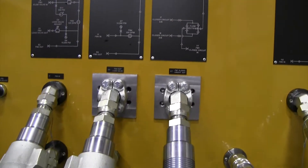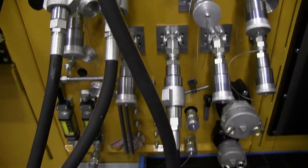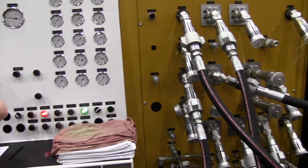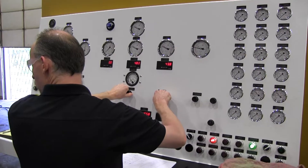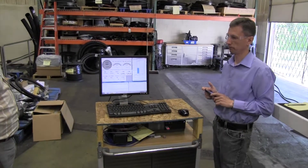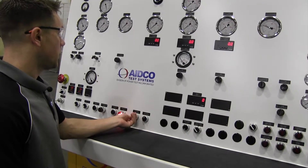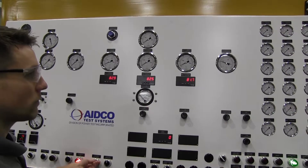Before adjusting for flow, we must first adjust for pressure on the aux pump. You cannot have flow without pressure, and there is no pressure without flow. For demo purposes, we turn the aux pump pressure adjust pot about one and a half turns, which limits the maximum pressure of the aux pump to about 250 psi. This pressure adjust pot sets the maximum pressure of the aux pump up to its maximum of around 6000 psi. This is useful if you want to limit the maximum pressure going out to your component under test. Now that the aux pump is capable of building pressure, we can adjust for flow using the aux pump flow adjust pot. The aux pump has a maximum flow of around 80 gpm.